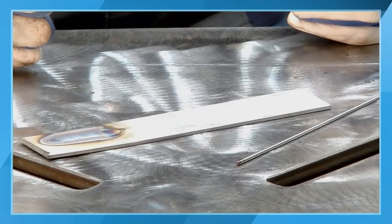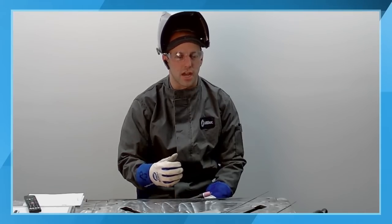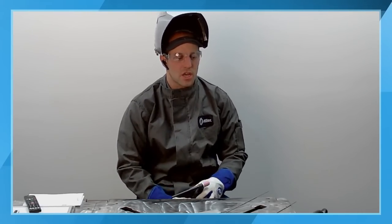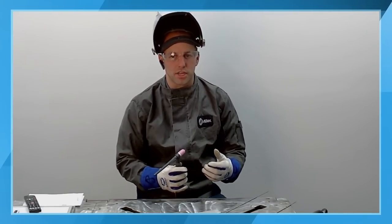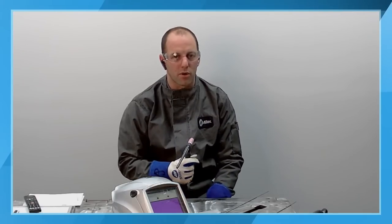So some of the things that can be beneficial for the welding process. If you are using a lot of stainless steel, or you're more of a production type welder, you've kind of mastered the basic techniques, you can use pulsing two different ways. You can use pulsing as a metronome if you're using a low pulse frequency. The most beneficial way is using a frequency of 100 pulses per second or higher, and that can be extremely beneficial because it helps keep the arc focused, helps prevent arc lag, and can help your welding puddle kind of follow along where you're pointing the torch.